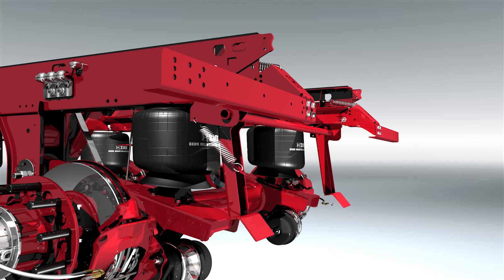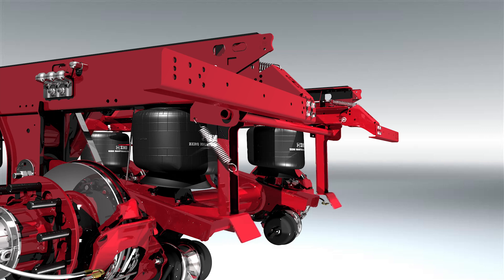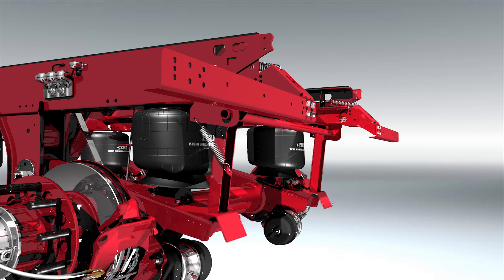Sherlock is an anti-dock walk system that works with the air springs to maintain ride height and prevent dock walk. It features legs behind the air springs that swing down to engage with the suspension beam to minimize trailer movement during loading and unloading.